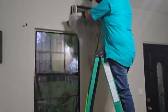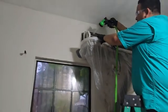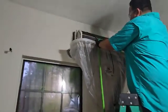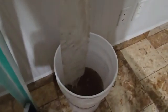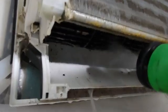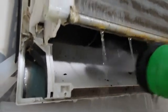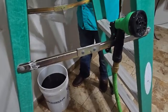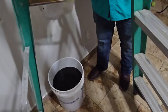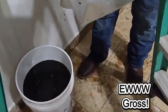Now I'm going to use that garden hose and nozzle to pre-rinse the coil and the blower, so I can use the coil cleaner after and knock off as much dirt and debris as possible with just water alone. You can see how I'm applying that water and pressure, removing all that dirt, all that gunk, and all that debris. This is just the first bucket — look at that water. Dark. Just dark. Gross.